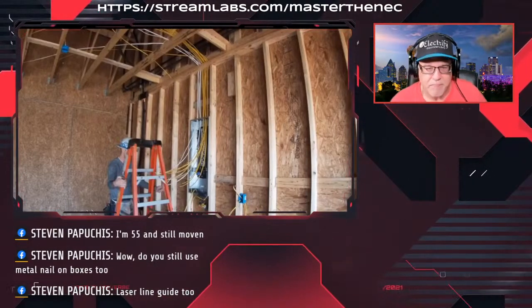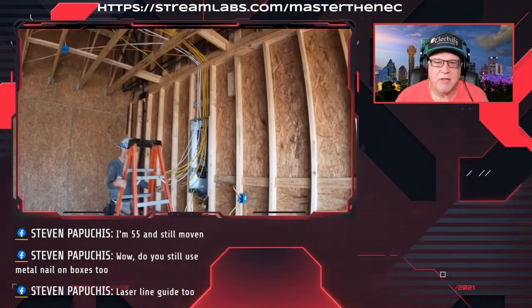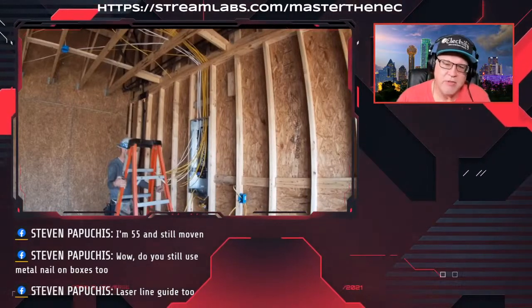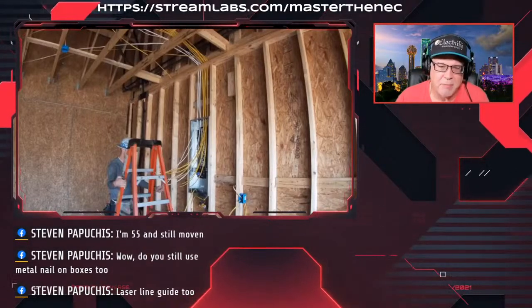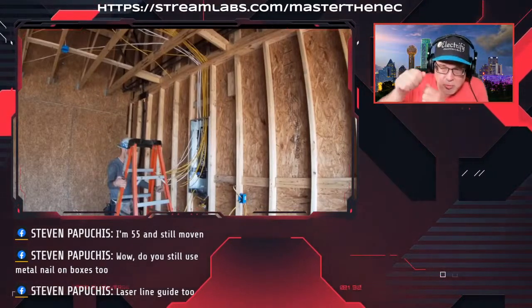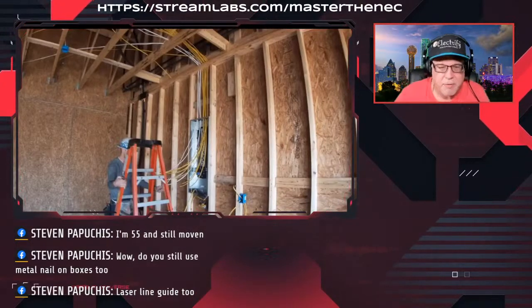Okay, I'm going to tell you a little story. They were having faults that were causing breakers to trip and arc faults to go off and all this stuff. So I went out there and started doing an analysis of what was going on. What I found out was that when they were cutting their sheathing off of their cables in the boxes, so they were putting them in the boxes with the cable still on it, and I know a lot of you do this, you reach in there and you slice it and you're cutting it from inside with your knife or whatever.